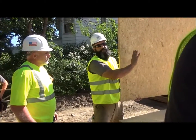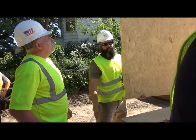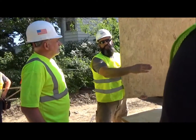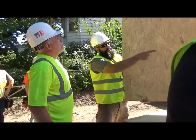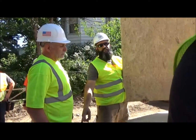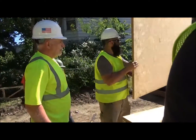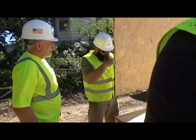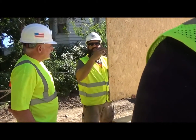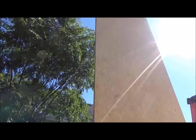You're going to do it roughly in the middle of the panel — about 4 feet in. You're going to go until you're at about a 30-degree angle, and generally you're probably as high up as you can reach off of that. With a 16-foot panel, that's kind of where you want to be. You can see just a little bit of wind takes this thing off. So when this thing gets set in, before we allow the clamps to fully release on the weight, we want that kicker in place.